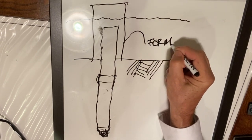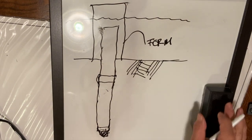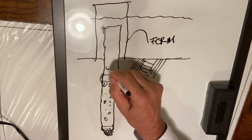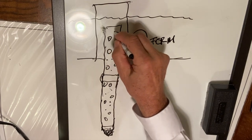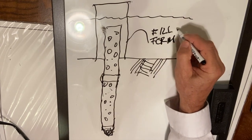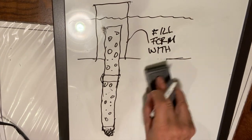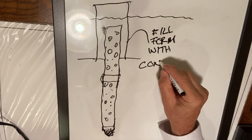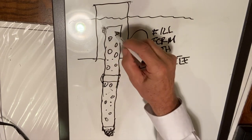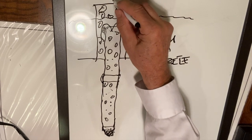This entire piping is full of water. Since there's a plug at the bottom, no sand got in — it's just water that has filled up throughout. Then you pour concrete in and the water gets displaced. The purpose of the form is so you can adjust your elevation to the appropriate height beyond the elevation of the PVC pipe, giving you much better control of the elevation of all your pilings. The water gets displaced as the concrete rises to the level that you desire, and then you place an anchor bolt.